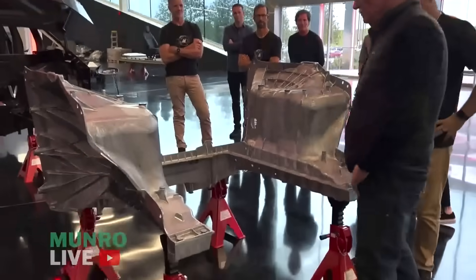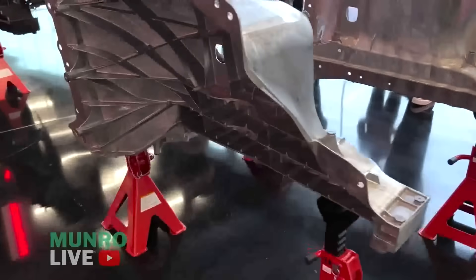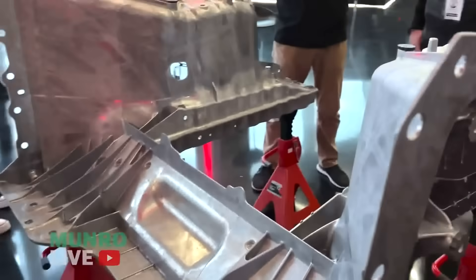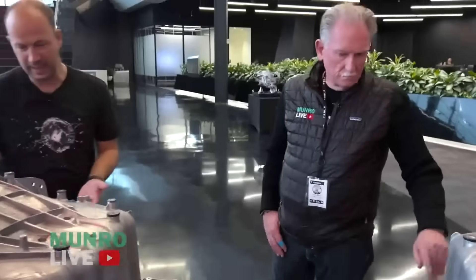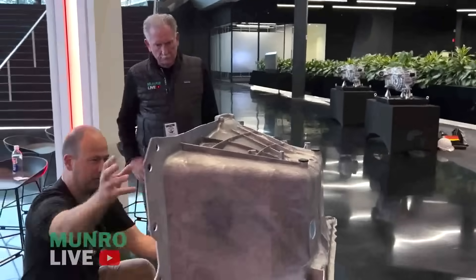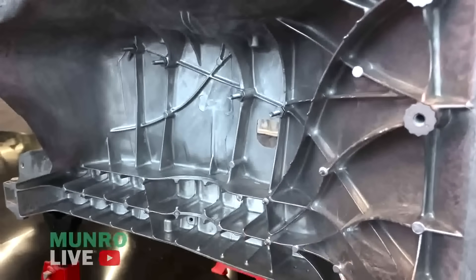It's just about flow, right? Like when you think about tonnage, it's about how much metal you're moving within the platen size and how fast you're moving it. But you can restrict that metal flow by making bad feeds and bad directions. But when you look at the side, the flow — the biscuit comes in through the middle right there. And then we flow it all out and we do it like a river because liquid metal wants to move like a river.